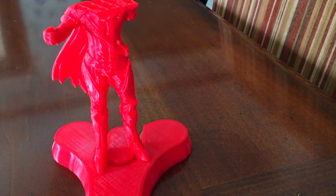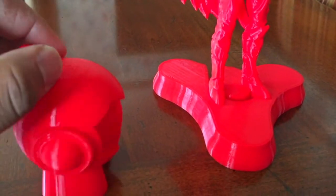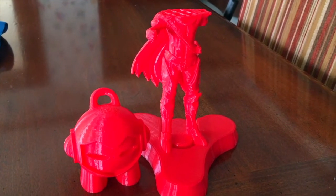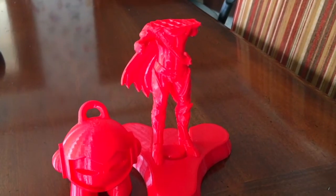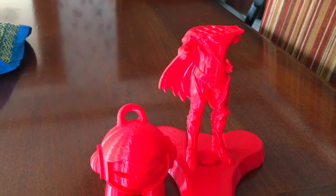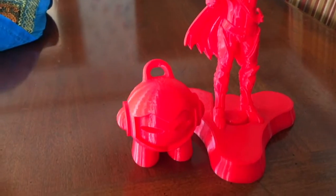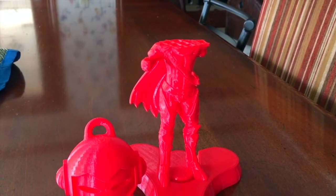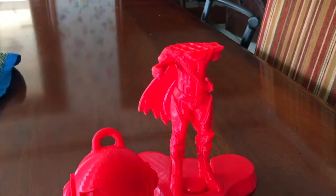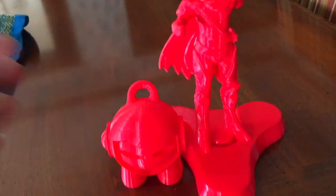That's it, guys. This is the AIO Robotics PLA — it's pretty cool and it was fun to print with. I've never printed anything with bright colors before, so that was kind of cool for me. I'd probably recommend this PLA if you're looking for something on the cheaper end. You can get the 0.5 kilo or a whole kilo for roughly $14.99. If you haven't tried it, go ahead and give it a shot — you might just like it. Both of these were printed at 0.2 at 45 to 50 speed with 5% infill. It's very strong filament, so I do like that as well.